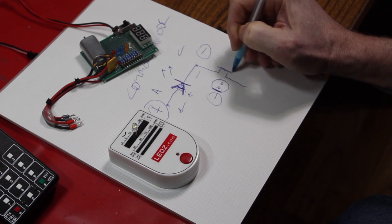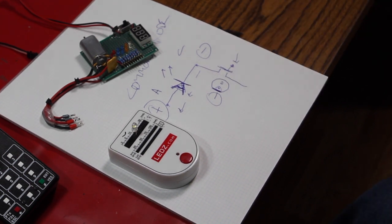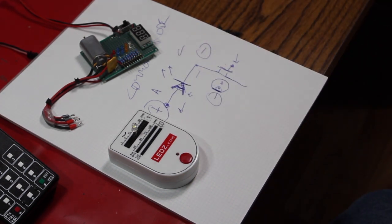That would have the signal to turn this thing on or off. Okay, this is just like old-timey cars, right? Where all your headlights and stuff are all wired up to the positive side of the battery, and to make anything work, you shorted it to ground. You turn this switch on, the ground connection is established, the plus side is already made, voila, we have light.